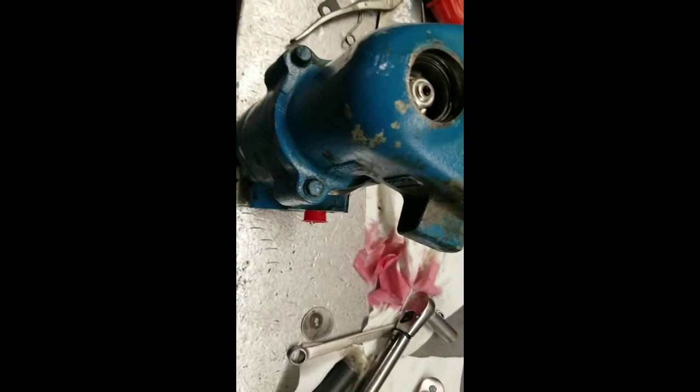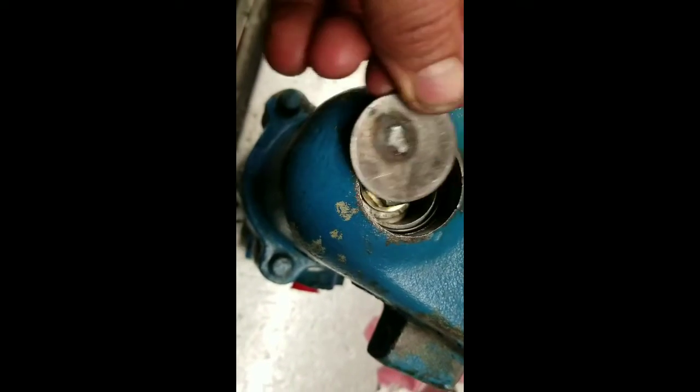I torqued the rear bolts using a torque wrench — I took them up to 35 foot-pounds, which I think is probably maximum on a three-eighths grade five bolt. I put an o-ring in here, a little plate is over top, there's a snap ring that holds that in, and I torqued these bolts. All we've got to do is put the gear in. I did put some oil in it — some automatic transmission fluid — and turned it over, and she is pumping. We're good to go.